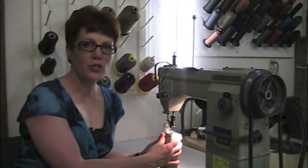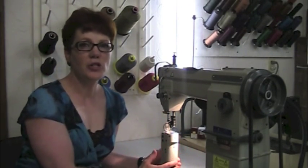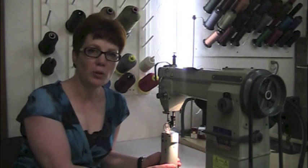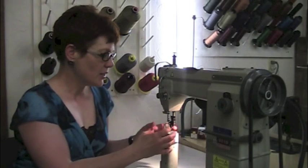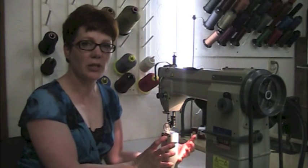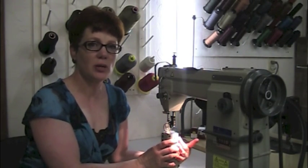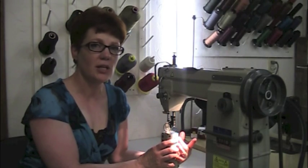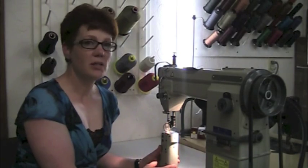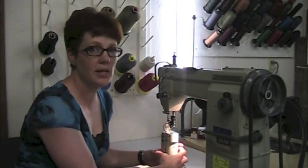The post on a post machine allows you to move excess material out of the way. So if you're stitching something three-dimensional like vamps, counters, or pulls on cowboy boots, you can make sure the area where you're stitching is flat but move excess material down here out of the way. It's harder to stitch something three-dimensional on a flatbed machine. I've actually stitched the back seam of one-piece tops on my post machine with the entire boot wadded down over the post.